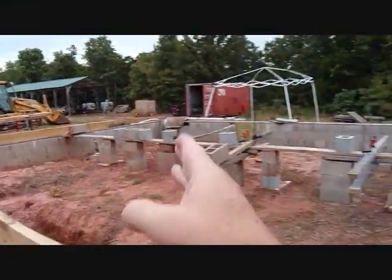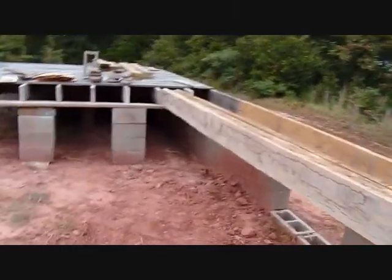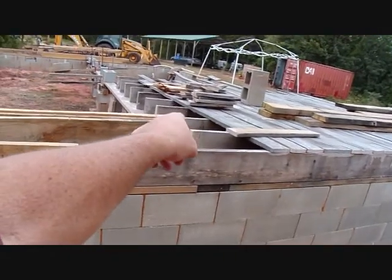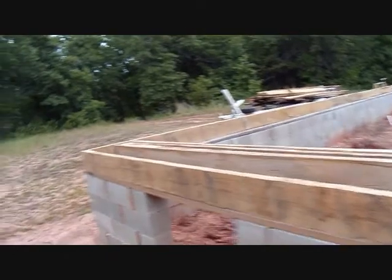It's gonna put it right on the edge of this vertical board here. And then when I get to that side is when I'll have to start measuring specific again. All these were from 142 to 141 and 3/4. So it varied a quarter of an inch, depending on probably some mistakes on these boards, cut a little bit longer or shorter, maybe a little bit of different width of the vertical boards on this side. So maybe they're a little bit thicker or thinner, which changes the distance on this side a little bit. But it doesn't matter because it's still square.